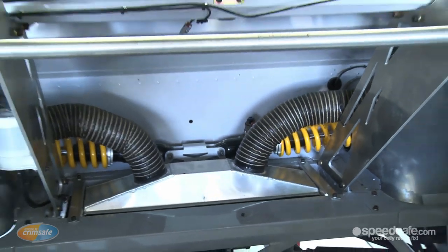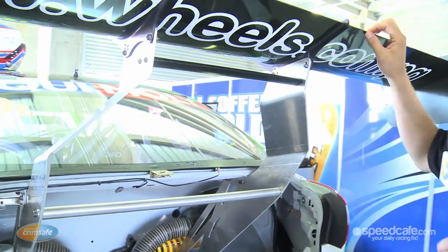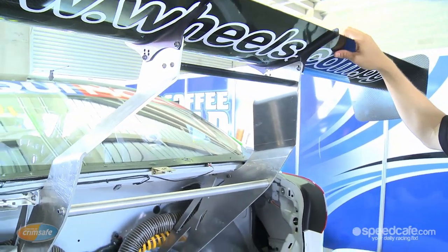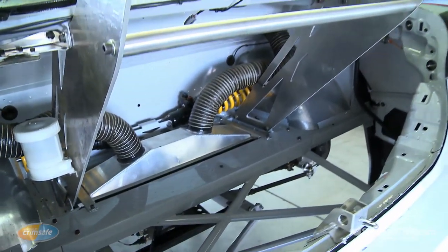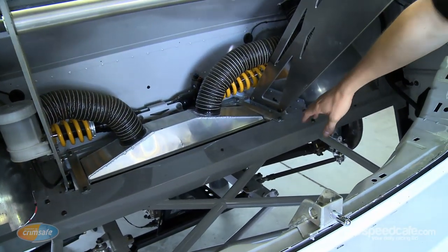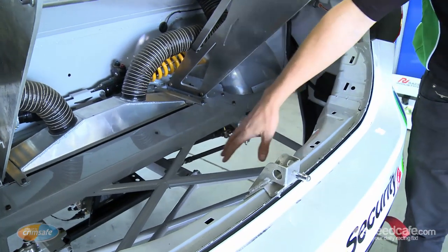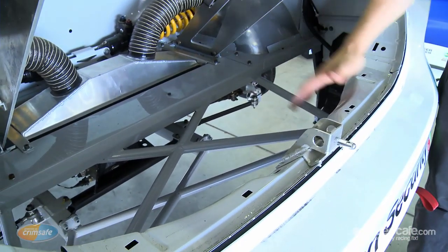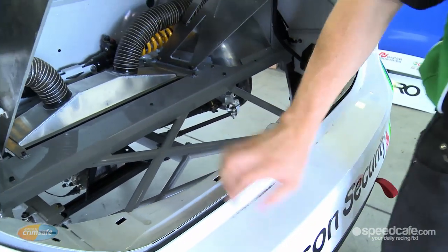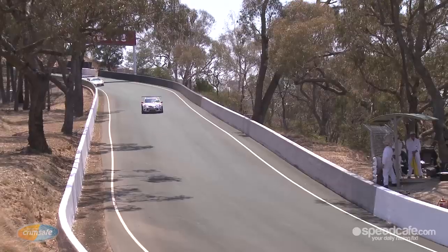And then our big wing mounts with our distinctive dovetailed wing design here. The wing is actually made in the UK and it's a full CFD design, as found on many sports cars in Europe, and it's mounted through these big aluminium spars which bolt directly to the chassis. At the rear you'll see there's a deformable crash structure. Down here this section of bars is replaceable, and then that bolts to the original Ford Focus panels which hold the factory bumper bar and the original tail lights.